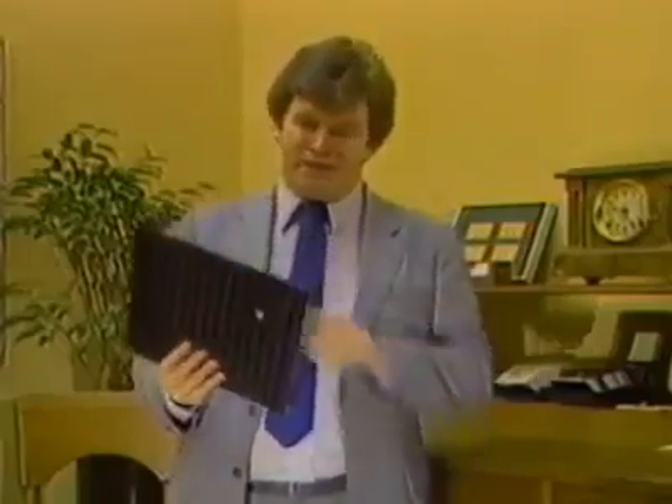Another point: if I had the sun shining directly on this panel, the panel can get as hot as 105 degrees — it's solid aluminum in a direct line with the sun. Let's say it was a winter day and it's 50 degrees outside. What difference would that make if the sun was shining directly on the panel and I had something at 105 degrees that I was sending freon through? The wind also contributes — it whips across the top of this massive surface area, eight by three, top and bottom, ten different panels. The friction of the wind will not only heat up the surface area and affect the freon gas going inside, but also cause a heat exchange to happen more rapidly.